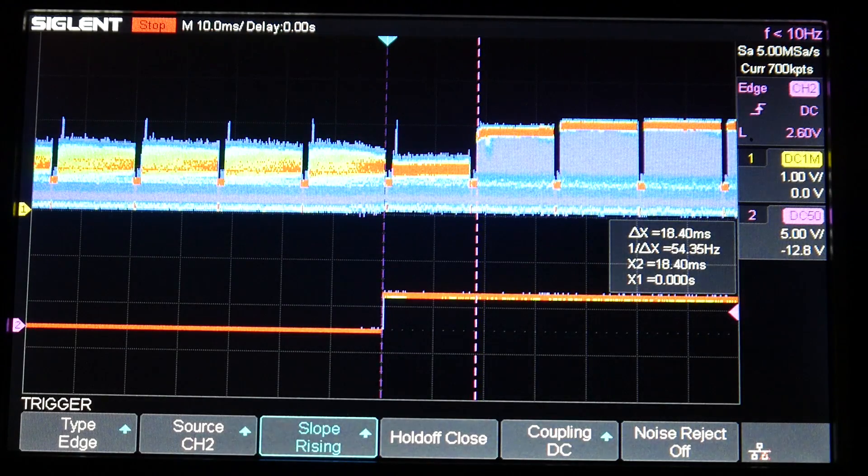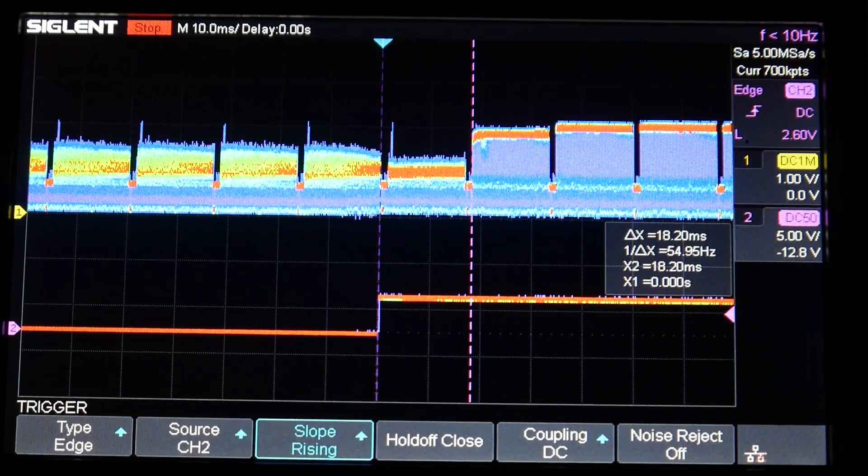This one's a little bit better: 18.2 milliseconds. I would give this an average of around 20 milliseconds of latency, possibly less. Overall it's a good camera — its latency isn't going to affect your flying at all, not like devices that let you watch your FPV feed on your phone, which have around 50 milliseconds latency and that does affect flying dramatically. 20 milliseconds will not affect your flying. The RunCam Swift 2 and Foxeer XAT are roughly in the 15 millisecond range, and this is performing just as good with only occasional above-25ms spikes.